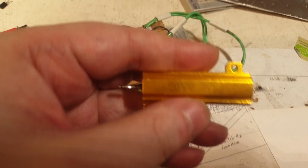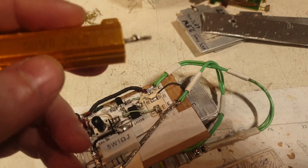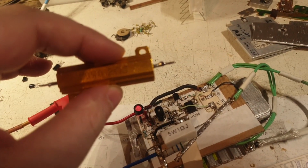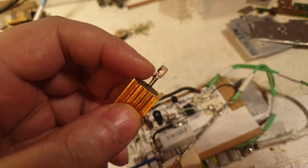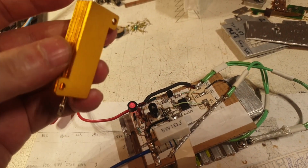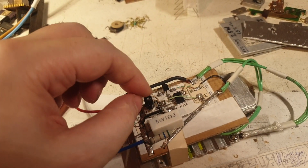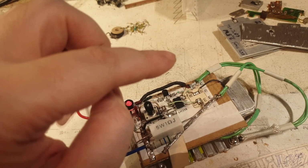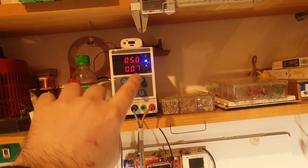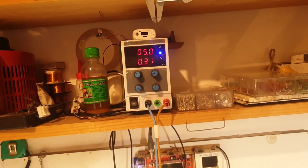The problem was, in the original circuit I was following specifically the values my friend used, and he used this 0.2 ohms, and I was having exactly this resistor. You can see it has the solder on it, and I was having it here instead of these 2 resistors. And because I was having this very low resistance here, when I was moving the potentiometer a tiny little bit like this, it was jumping a couple of hundreds of milliamps. So when I was moving the potentiometer, these milliamps were jumping like crazy. You see, not as smooth.